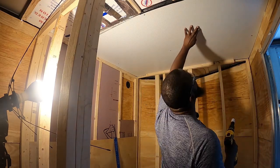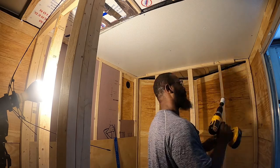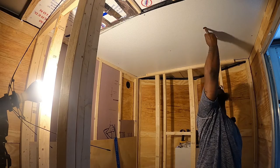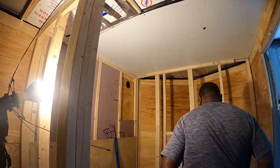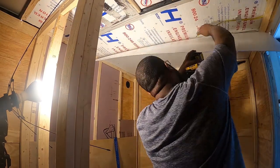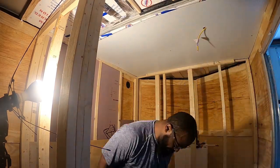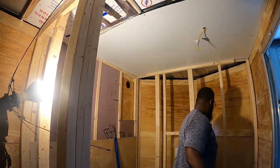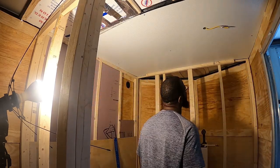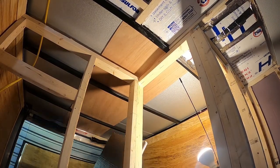I don't know if you can see it too well in the video, but I actually have a brace holding up the end of the wall. Later on, the end wall will have 1/8 inch plywood and FRP, and the trim fitting that's going to sit on the FRP on the end wall will end up holding up the ceiling. So I'll probably use a little glue and then just have that end wall fitting hold up the ceiling. So it should be fine. But right now I have this brace in place, and I'll come back later and put an aluminum L channel there to secure it.